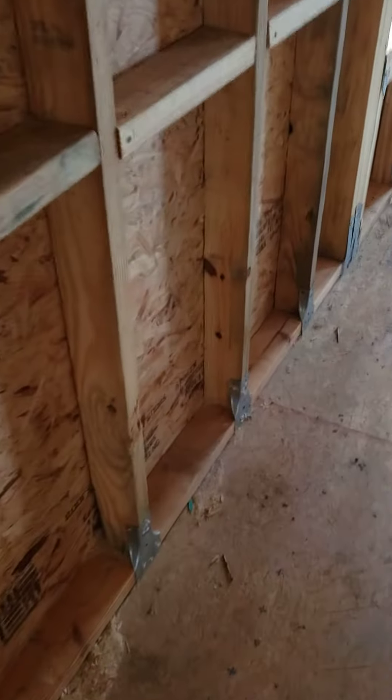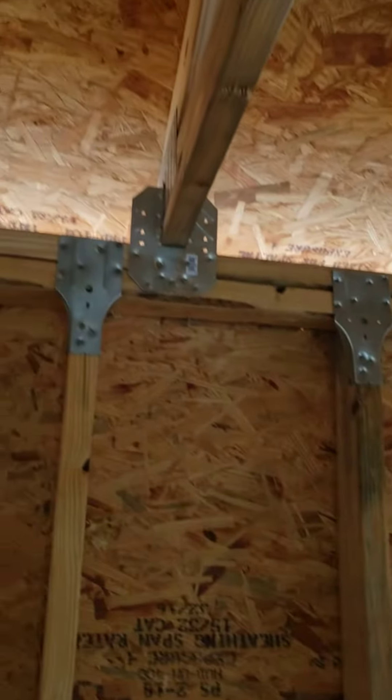And here's how your system is fastened to the wall. These are all kind of hurricane straps. That's how the roof truss system is fastened to the top plate, which is very important here in Florida, because we don't want to deal with uplift.